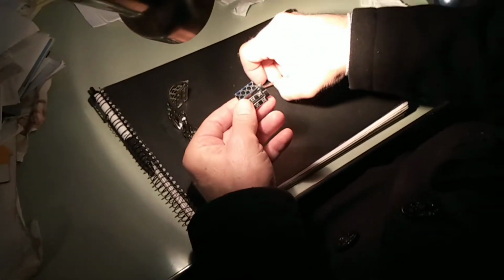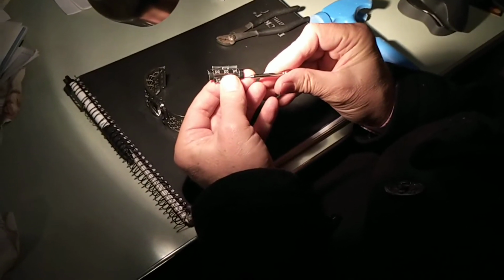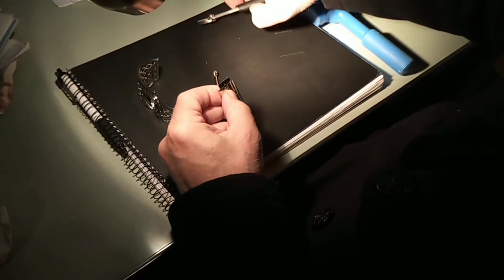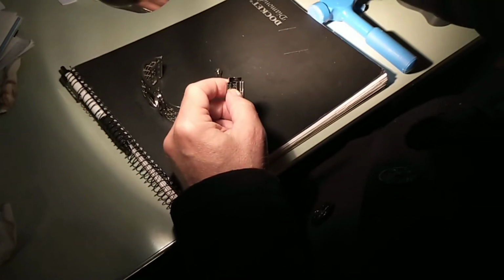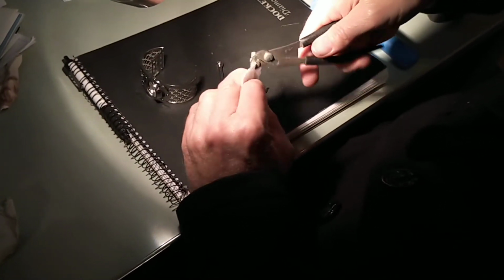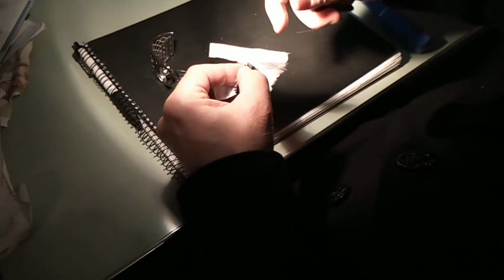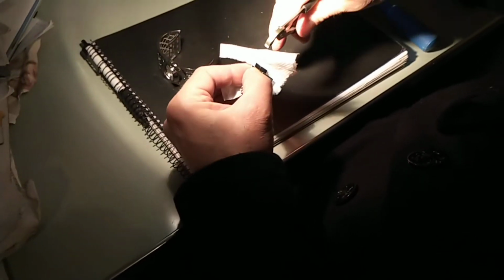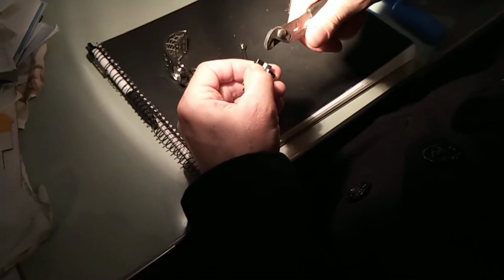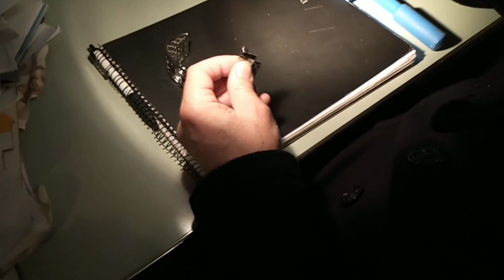Okay. When you use the 0.8mm tool to drive the pin out here, it's going to pop out a little bit from the far end. Take a pliers. You might want to wrap them in a towel or a rubber lid jar opener so that you don't chink your pin. Pull the pin straight out. Don't twist it because it might snap off. Don't bend it. Grab it, pull it straight out. That's how you remove the pin.